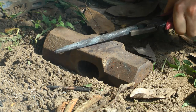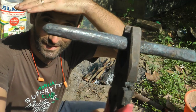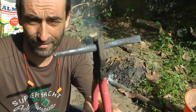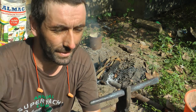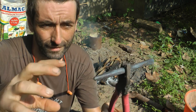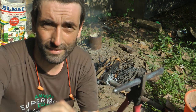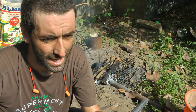One more final adjustment and that's what it basically looks like now — I'm very happy with the shape. Before I do any cleaning up or hardening and heat treating, I'm going to normalize this, which means heating it up to cherry red — a bright red — and that's where a magnet won't stick to it. That's how you know you're at the right temperature. It's the same temperature you'll use for hardening the steel later on.